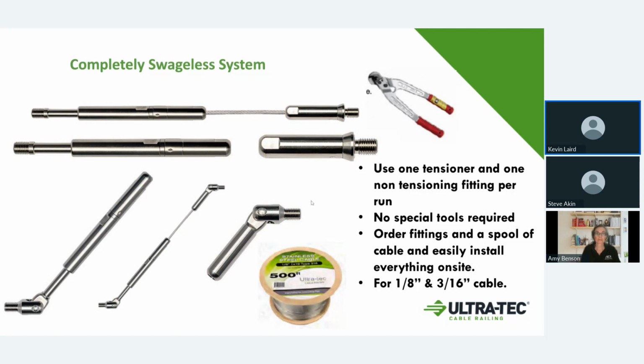Most of these fittings here are all showing for a metal connection into a metal post. Those are all drilled at a 5/16 24 thread. Whereas for wood, we have a lag screw attachment on the end of all these fittings to where you could use them in a wood post system.